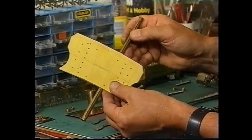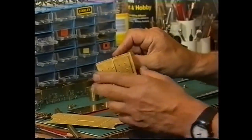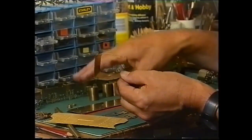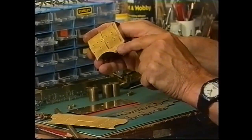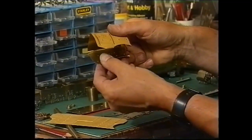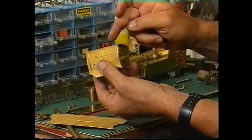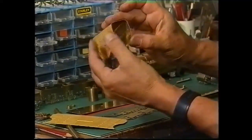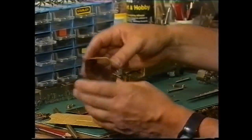The larger radius is on the side - we've got quite a large curvature there, and that's a simple matter of laying on a piece of rubber and using a half-inch bar, just rolling like a rolling pin, and you'll find it comes around very easily. Use the formers and keep checking. Again the reverse curve at the bottom brings it down to the footplate - a piece of bar on the outside, fold it over and gently coax it into place using a thumb or piece of softwood. Always use the formers to check your work as you go along. If you find you've put the curve in the wrong place, don't worry - you can move it by shifting the bar slightly and pulling down the side. That radius can move without showing a kink, and that's the firebox.